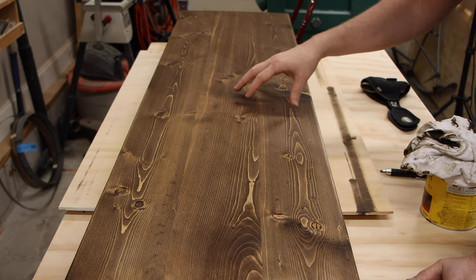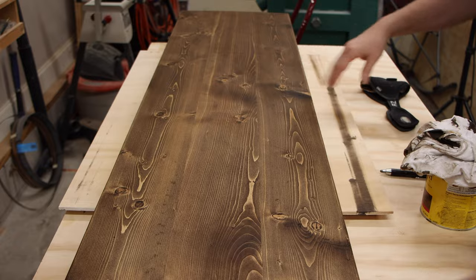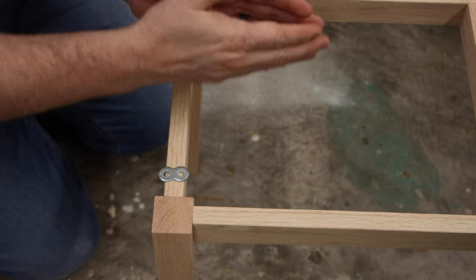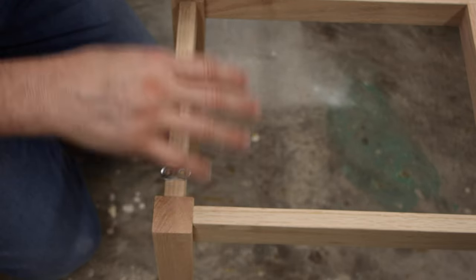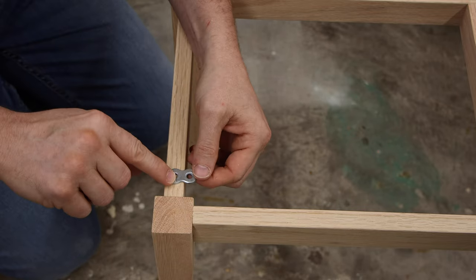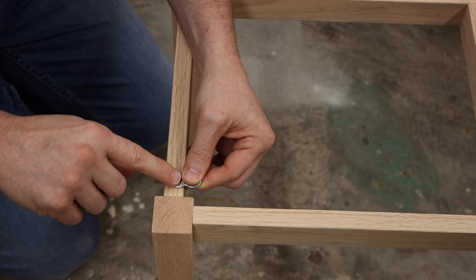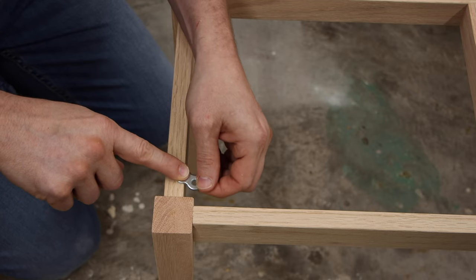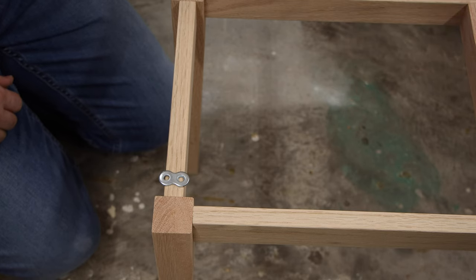It's the end of the day, so I'll let this sit and dry overnight, and tomorrow I'll spray the base and put an oil-based polyurethane over the top. Before painting the base, I'm going to drill the half circles for the figure-eight fasteners. The top will expand and contract across its width — if we attach it permanently it won't be able to move and that can cause cracking. Instead, we attach the top to these fasteners, which swivel with the wood as it moves. I'll put three on each end apron and three on each middle support.